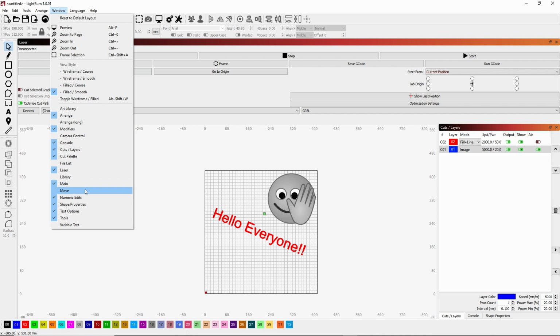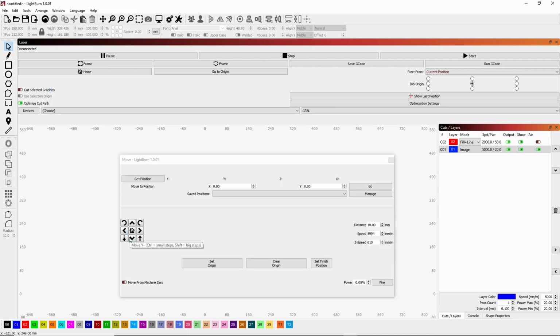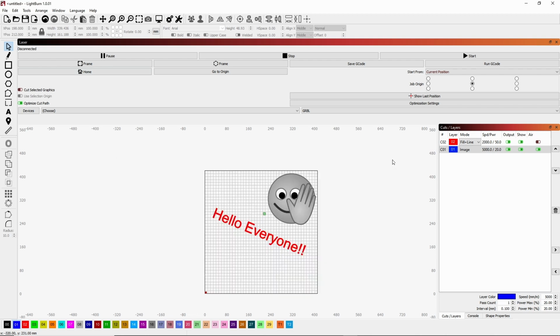I'll show you here. Okay, so when you move the laser around using these buttons, okay, and move it to the center-ish of the screen, of the work area on the engraver, okay, then you can put your piece under the laser and measure, use a little focus aluminum block thing and focus the laser, and then you center your piece underneath the laser so that as soon as you start the laser, what it's going to do is wherever you center that piece under the laser, that is the center of your project.